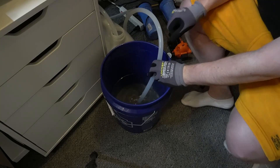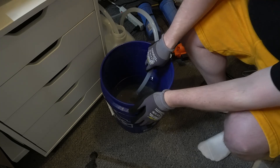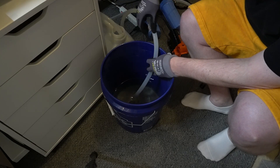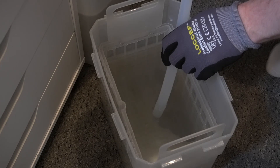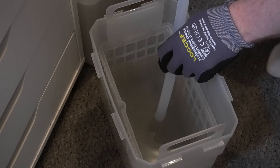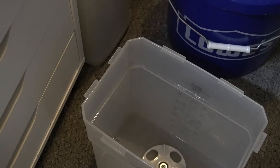The next thing I want to do is decant off the used IPA that I've had sitting in a bucket. I'm going to use my little diaphragm pump and my filter setup — it's a one micron and a 0.5 micron filter in a row. I'm going to decant off the top into an empty container so I can use that for the wash solution. I'm also going to take the pre-wash bucket that's been sitting for a couple days and decant off that too — sucking the IPA that's had colorant fall to the bottom, putting it into my spare container, and then sucking it back out into my pre-wash bucket. That's what we're going to use to wash parts.